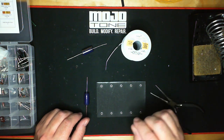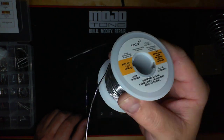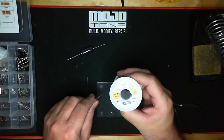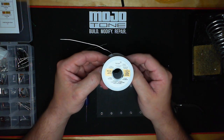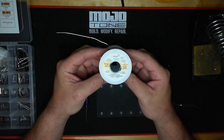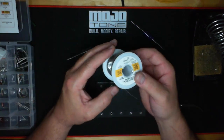For PCB stuff I like to go down a little bit, around 375–400°C. It also depends on the solder. We use a Kester — this is the solder we actually sell at Mojo and it has gotten me out of so many bad bonds. It's just great all-around, general purpose solder. In manufacturing we had gone the lead-free solder route and the learning curve was so steep — you need the right equipment and correct prep work. Working on vintage equipment, we were winding up with a lot of cold solder joints and kind of had to abandon it.